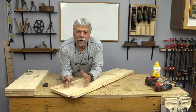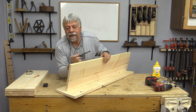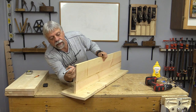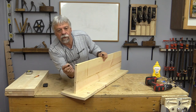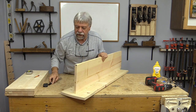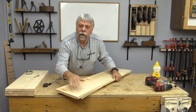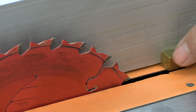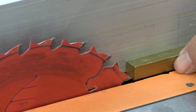I think I've been referring to the notch I need to cut out on the back of this bookcase as a dado — it's not a dado, it's a rabbet. It's just a little cutout like this that needs to get made. Normally I would do this on my router table, but to keep this as simple as I can we're going to go back to the table saw. I want to set the width of the cut at three-eighths, so I'm using my measuring bar.